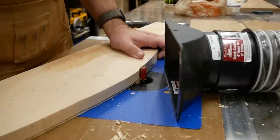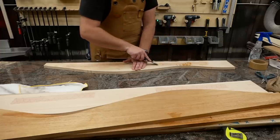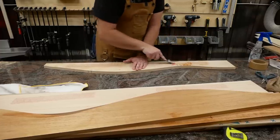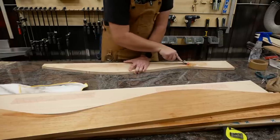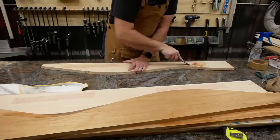Even with all this work, I still had a minor incident. With the curve finishing done, I could unstick the templates from the work pieces — and again, this is not a good task for carpet tape. Carpet tape is too permanent. I had to spend a good hour with the acetone and elbow grease scraping the tape off of these boards, and even then it left sticky residue.